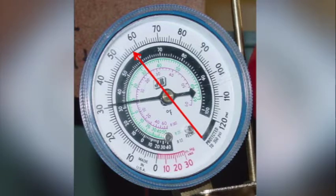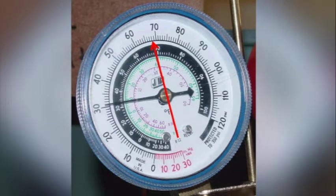The other arrow is pointing to approximately 68 psig. If you look at the green scale — the middle of the three scales — we see that it is now reading approximately 40 degrees. And that is what we want to see ideally, so that we have a 40-degree evaporator.